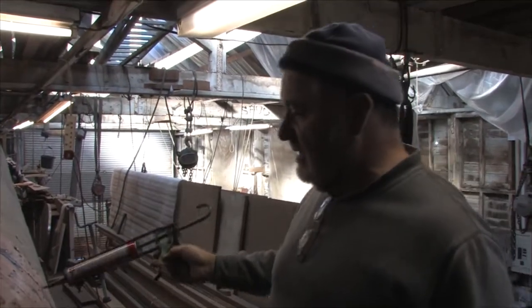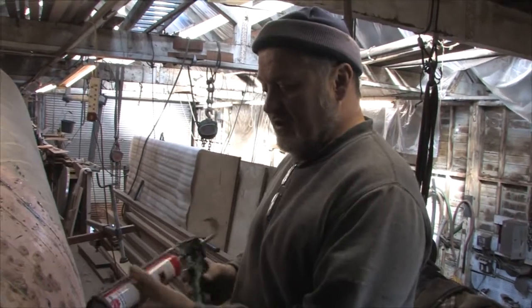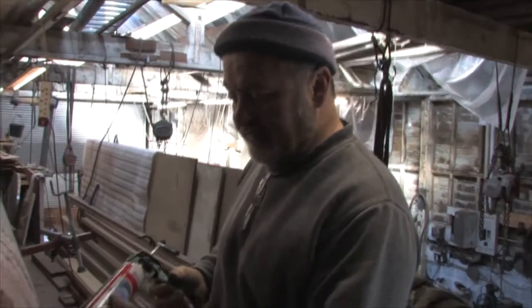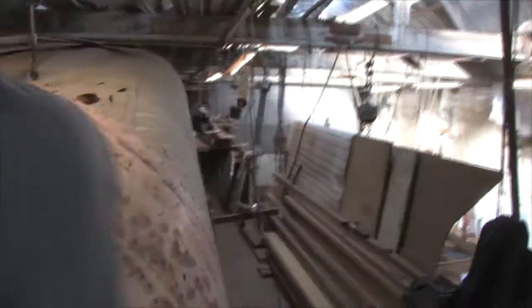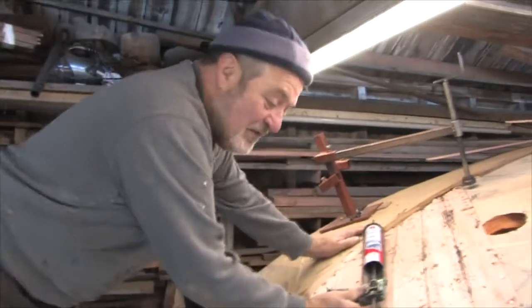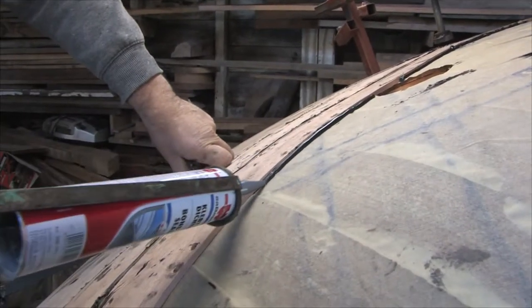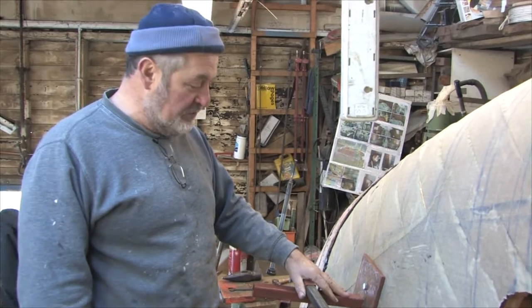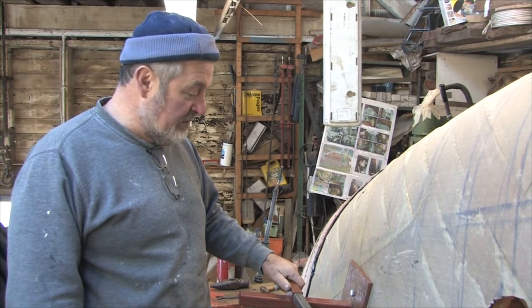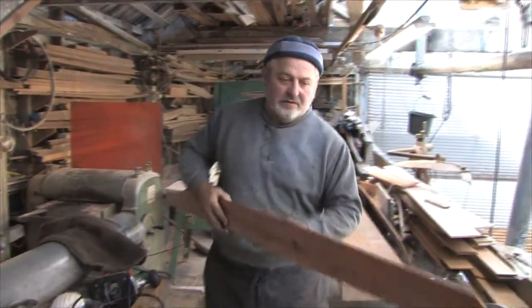Right, so we'll have a look upstairs now — we've got a bit of work up there going well today. We're busy putting some boards on the canopy. This is the final skin. We're putting a rubber bonding on between the seams — this is from Worths, we get this, it's very very good stuff. It takes paint and it takes varnish and it sets pretty hard to rubber, you can cut it off quite well. We'll rub one up first. It's getting a bit precarious for working on because we're making something so smooth it doesn't give you a lot of grip. These are the cramps we showed you in an earlier edition — they're now actually getting used and they're working very very well. In a few minutes we'll show you how they actually work. We'll just get a board out of the steamer and put it on.